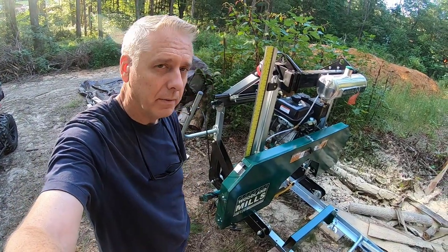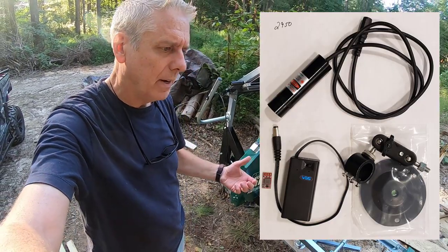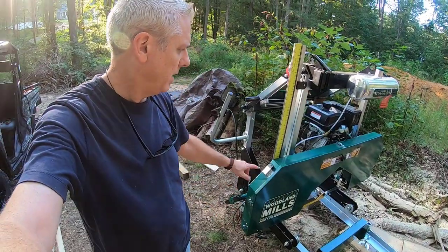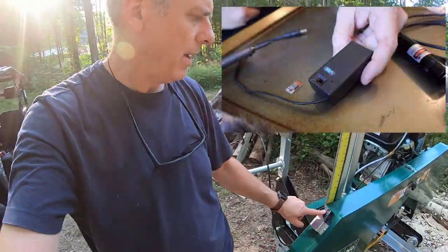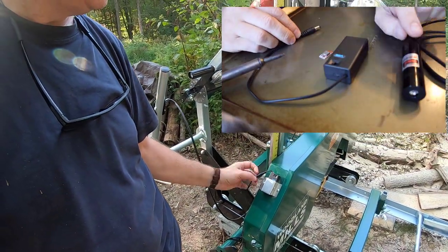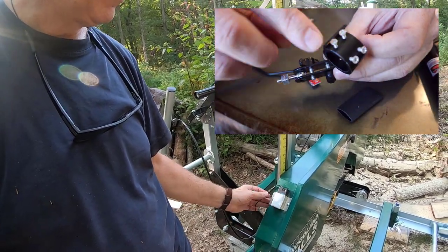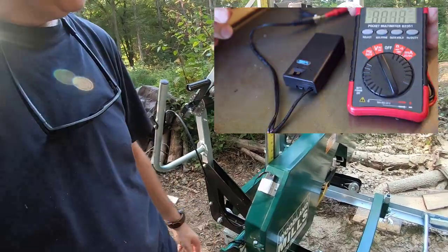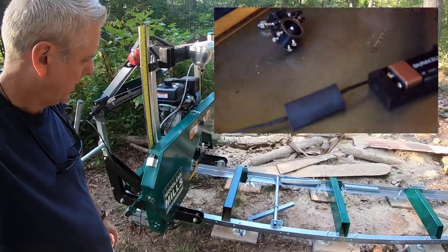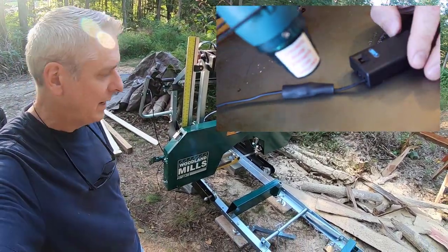The laser itself was really like 19 bucks, although I bought it with the mount and an adapter, kind of like a transformer. So that was $36. And then this piece was $5 for the battery holder, and it happened to have the exact right plug on it. And then you saw me solder in the step down transformer in here to go from 9 volts to 5, and that works really beautifully. So that's in there, and that was it. So at 36 plus 10, $46, and then some labor, of course, to solder and put it together. But it turned out great.